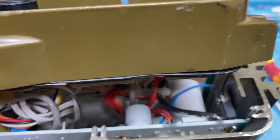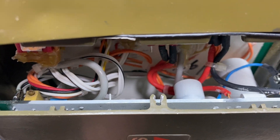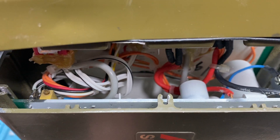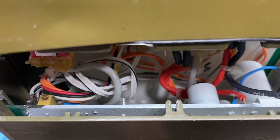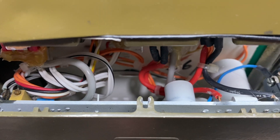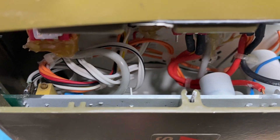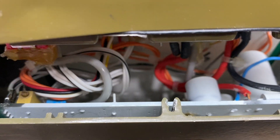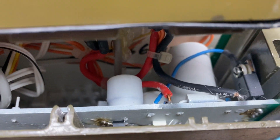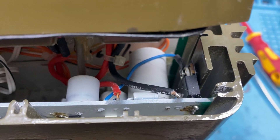I had to rebuild it. There are chips you can't get anymore — like a 271 DIP package. I had to make a converter board and find a SOIC package and put it in there. I had to rebuild the power supply and replace the front end. I had to do a lot of work on this. Anyway, he sent it in for warranty repair after seven years.